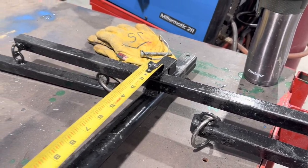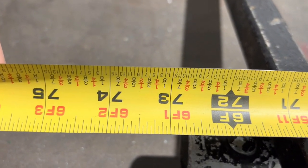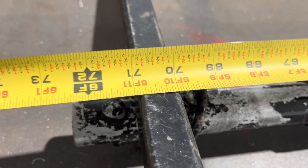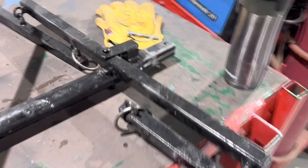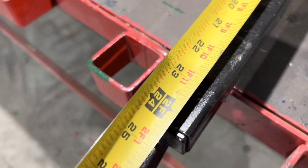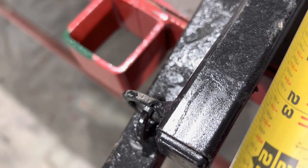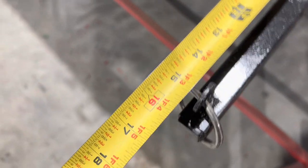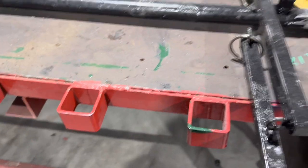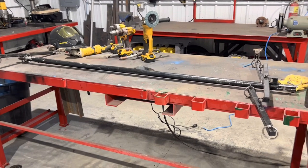So I'll go right from the evener to the end of the pole is like 73 inches, say. And the neck yoke is 2 feet. And the evener should be 2 feet. And so it's just over, and then these here are 16 inches. So hopefully there was something in there that he was looking for. If not, he can get back to me and let me know.